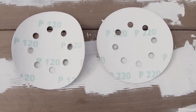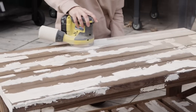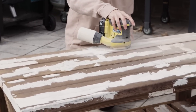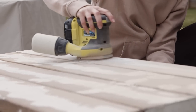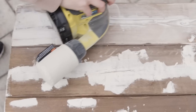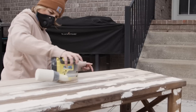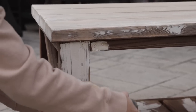I'm using a battery-powered orbital sander and I'm going to start with 120-grit sandpaper to smooth out all this wood filler, which is rated safe for exterior use. When you're using wood filler outside, you want to make sure it is rated for exterior use. Once I get all this wood filler smoothed out I'm going to go back in with 220-grit to smooth everything out. Everything I'm doing here is just to repair the condition of the table — none of this is necessary to prep for the primer or paint I'm using today.